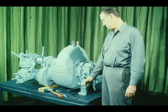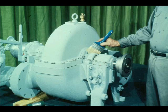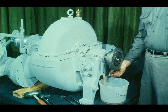We will be working with a turbine that has already been removed from service and sent to the shop. The procedure we will show you is in-shop and does not include field work. Next, put on the personal protective equipment recommended by your plant. Don't take chances — you could hurt yourself badly if you're not careful while working on this turbine. Cleaning the exterior of the turbine prior to taking it apart is considered good practice. This will remove dirt that could fall into more sensitive parts. Use the cleaning method approved by your plant. After the turbine is clean, drain the lubricating oil from both bearing housings and dispose of the oil in accordance with your plant regulations.